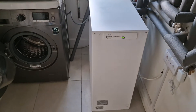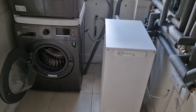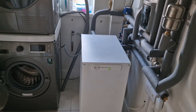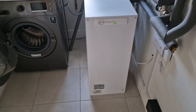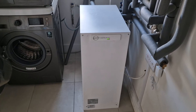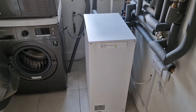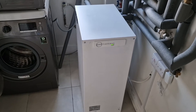With these units you need to charge them using the heat pump — you need to set the heat pump to reach about 65 degrees to fully charge it. That's where it's quite good that this uses the R290 refrigerant, because it can reach up to 75 degrees and can definitely reach 65 degrees even at minus 10 or 15 outside temperatures.